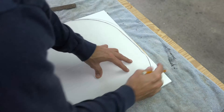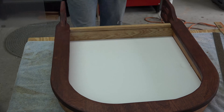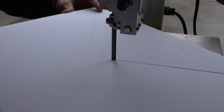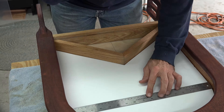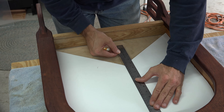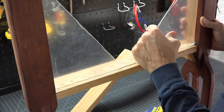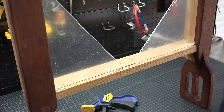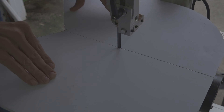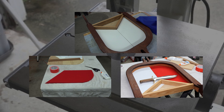Grab your plexiglass and trace out the shape directly on your foam board, then cut it out. Place it inside your box and grab your ensign triangle — place into position and trace out directly onto the display board. I cut my display board an eighth of an inch smaller, but for this box skip that step because we will be cutting the display board in half, which will negate the need for an eighth-inch gap. Find the center of your display board and make a mark, then draw a line from it to the top of the triangle. Using some scrap plexiglass, place the pieces in the glass groove at the base of the box. We are now going to attach the ensign display. If you are using real glass, you need to install the glass before this step. Due to the mounting of the large knife, the next step in this video is a video in itself — if you are interested in how I mounted the knife and applied the felt for this box, click here.